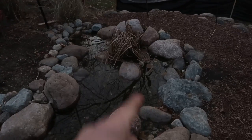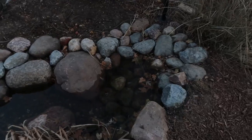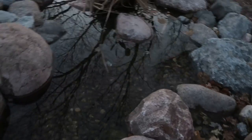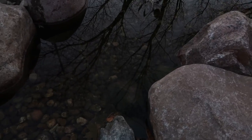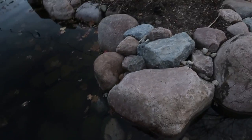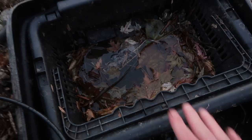The hole itself was a big rectangle, but we definitely disguised that with boulder work. The liner comes back up over the top of the aqua blocks and behind the rocks, and the snorkel centipede clean-out is located right here underneath these cobbles. You can see the biofilm is already starting to form — or is already formed — on the rock and gravel in there, and that's all the good stuff for the ecology of the pond. This is an upflow filter: water is naturally filtered biologically as it comes up through the different layers of rock and gravel, pushing debris from this back cove out across the surface and into the skimmer box.